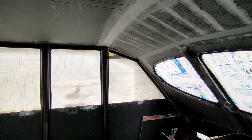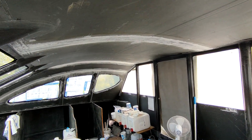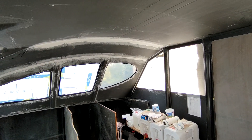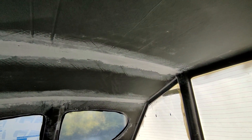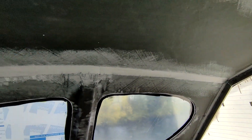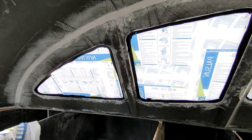With the first warmer days in April, we started working inside the yacht. We began with reinforcements that hadn't been done inside before. These are reinforcements of the connections between the roof elements, between the deck and the superstructure, and the connection from the main beam forward inside the front of the bridge. All of this requires lamination using the appropriate kind of carbon fabric strips.